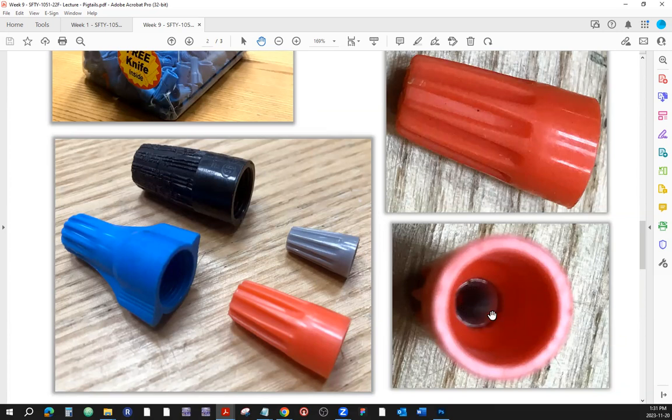What do I mean by that? If there's some wire that is stuck from previous installation, somebody took it off and just dropped it in the drawer, you won't be able to insert the wires that you're trying to connect into this comb because there is something already there. So just make sure that this thing is free of any obstacles for the wires to get in there. Right?